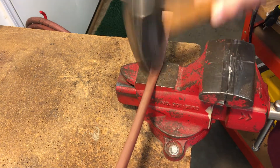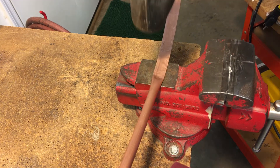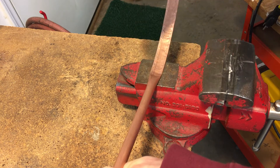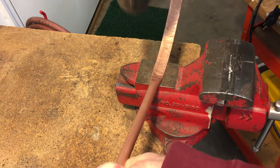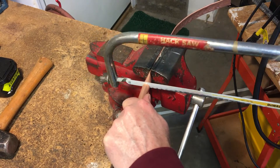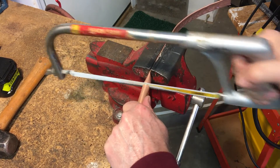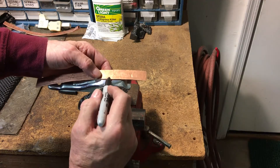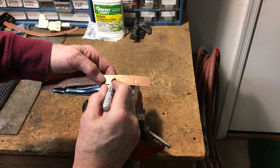It is made out of heavy metal with a very strong grip. I had some 3/8 inch copper tubing in my junk box. If you don't have any lying around, you can buy a single foot from Ace Hardware. Flatten about 8 inches of the copper tubing with a hammer, then cut off the length you need. You want the length to be about 2 inches longer than the total length of the clamp.